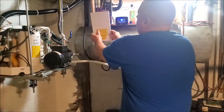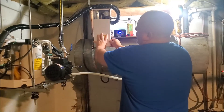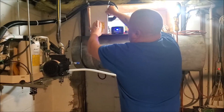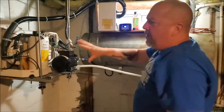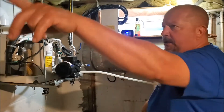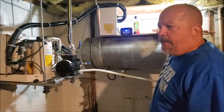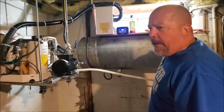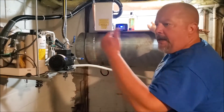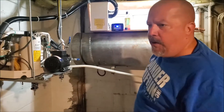What I'm also going to do is probably box this out as a room, so my return air could either come from the return on the air conditioning system supply, or I could open up this window and use that as free cooling — so when the temperature drops low enough at night, I could bring that air into the house without having to run the compressor.